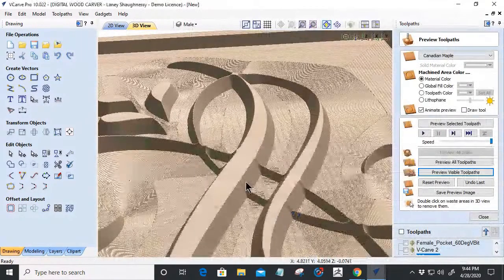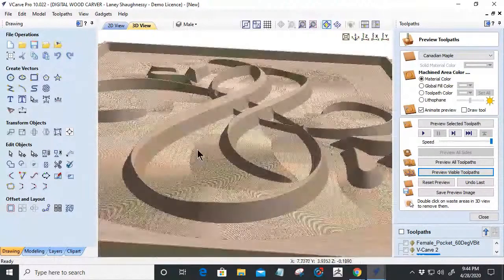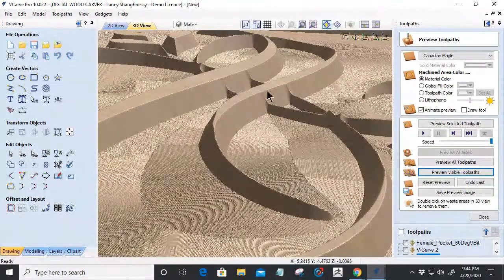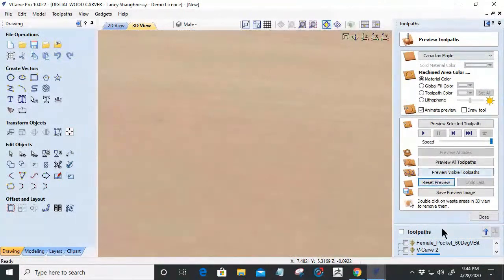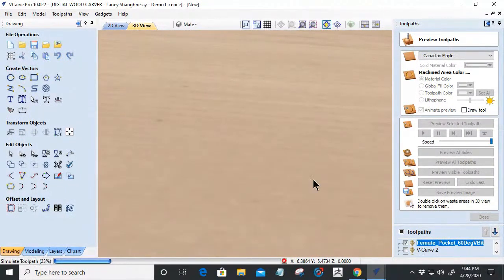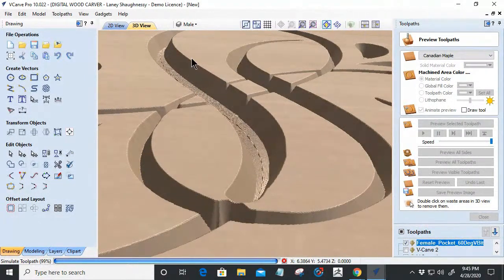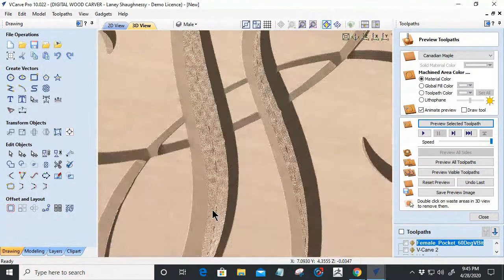All right. Let's look at this cut. All right. So our V-shaped cut here. Nice cut depth, flattened off at the point too, you know, everything, but nice flat depth, no straight ridges in here that's going to block my piece from getting in. This is the flat area here that will fit into the flat area here in my female area. That V bit's going to come down to that nice flat area and fit into that part, you know.